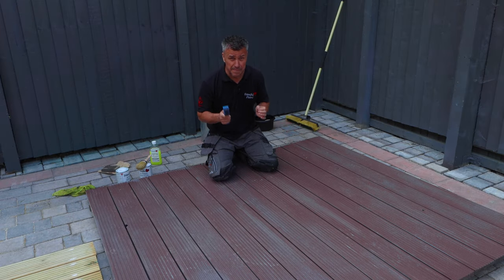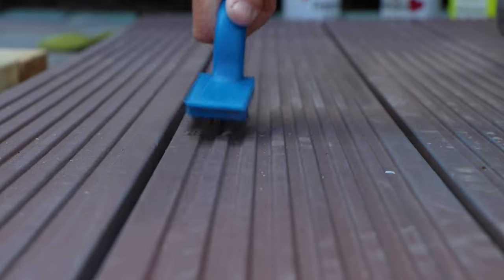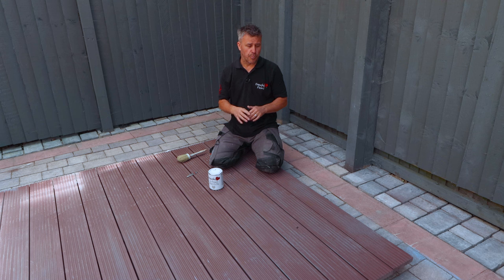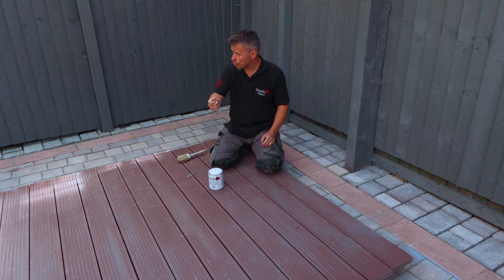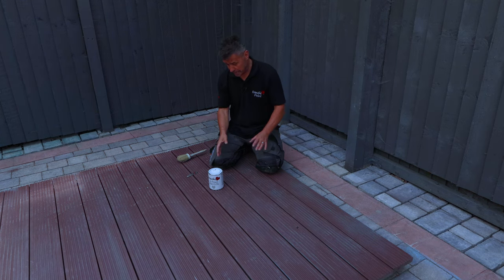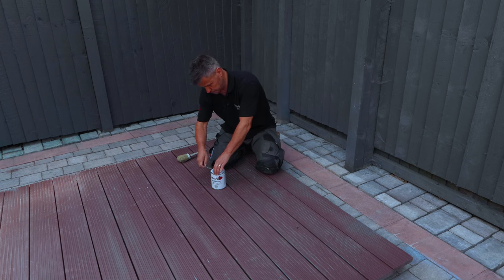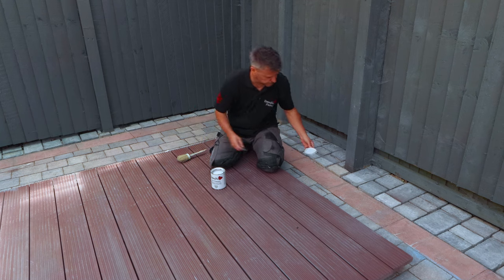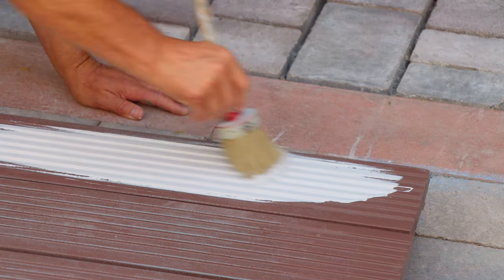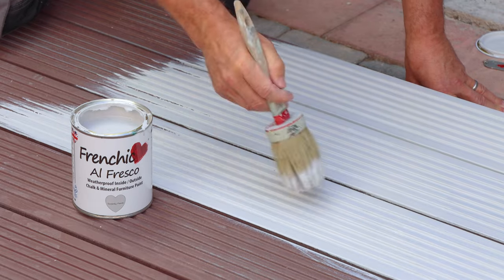It's also wise to give your paintwork a good inspection — get a little wire brush and go along all the edges to see if any paint is flaking off in between the grooves along the edges of each piece of timber. This section of decking has now been prepared: it's had a good clean, a sanding down, it's been scored with the wire wool brush, and there are no flaky bits — so I'm happy to paint directly onto the surface. This time I'm just going to give the tin a little shake and apply it directly from the tin without diluting, straight onto the surface.